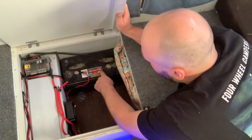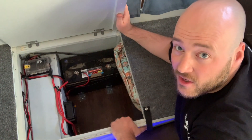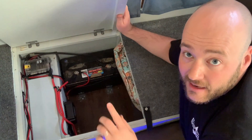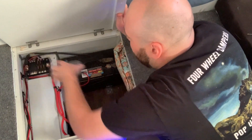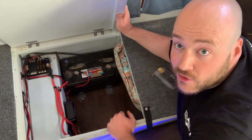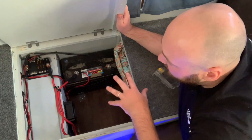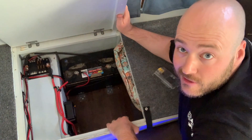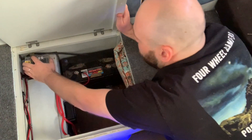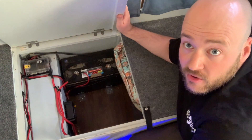Also coming off the battery, I have some super big gauge wire that runs over to my fuse panel. I went with a Blue Sea fuse panel — the good stuff. It is way overkill for what I have. I've got the lights fused out, and I've got a simple 12-volt power system fused out, and that is it — just two systems running out of a total of six channels. So plenty of room to expand if I ever wanted to. I went way overkill on the wires so that I would be getting the most juice out of everything. The fatter the gauge wire, the lower the resistance, and the more of the old sun charge you get. Let's keep it going and talk about the controller and some of the other peripherals on my front panel here.